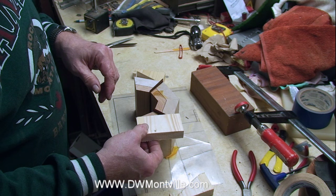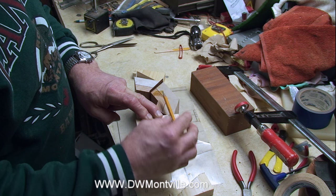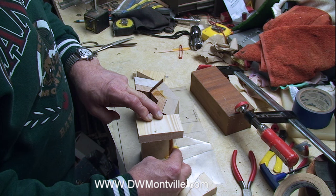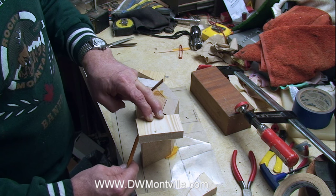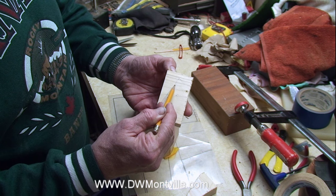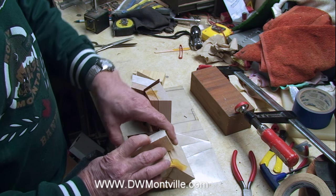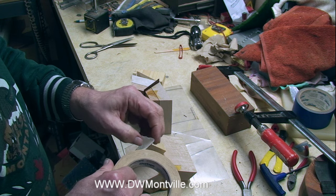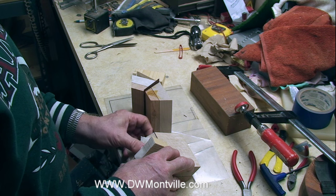To make the clamp shoe, you just get a small piece of wood that will be big enough. You put it on the piece you already have glued up — running that line through there will give you a surface area to clamp on to. Then you just take your pencil, go underneath, and draw a line on the flat surface of the lower piece. It's important that you get this line, and then you'll end up with a wedge shape here that you want to cut out. Once you do that, when you hook it on the lip, you can position it near the center and use masking tape to hold it in position while you get things lined up.